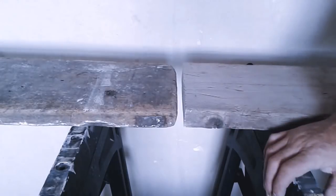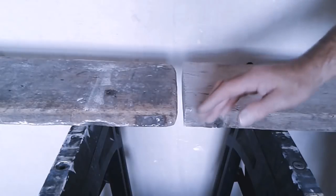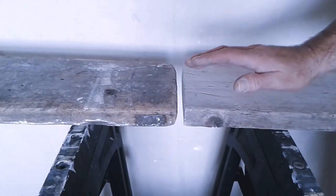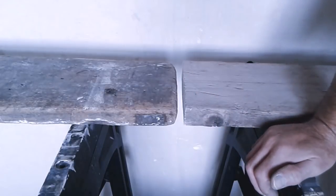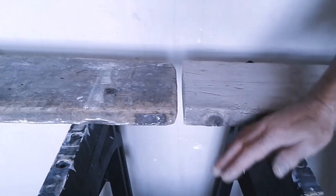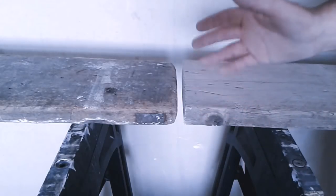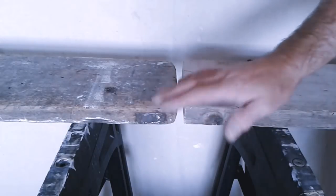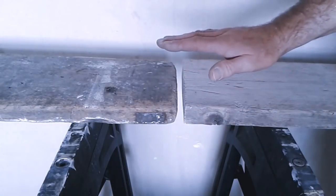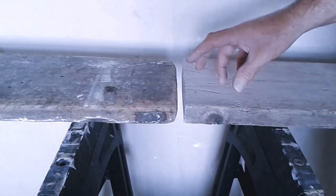When using these building trestles for building walls, if you're building from the ground up, you work to your height, then you move to your trestles and build up again to a certain height before maybe moving on to scaffold. This allows for the build to proceed at the bottom without the scaffold interfering with any work.